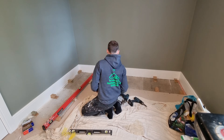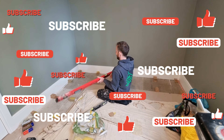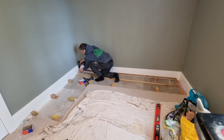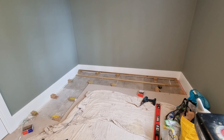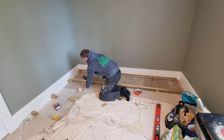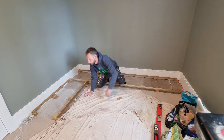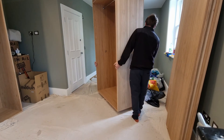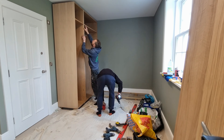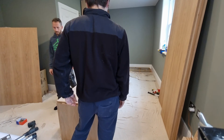As you can see, bearers are going down and I'm levelling up all the spots where the sides of the wardrobes are going to be transferring their load down. Each block corresponds to a side. I've worked out that the height from the carpet to the top of the bearer is generally about 60mm. We use a selection of packers — 1mm to 3mm, 6s, 12s, 18s — whatever we need. We've got bags of them cut from offcuts in the workshop.